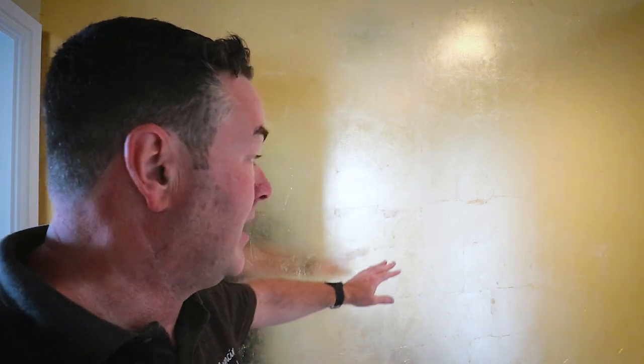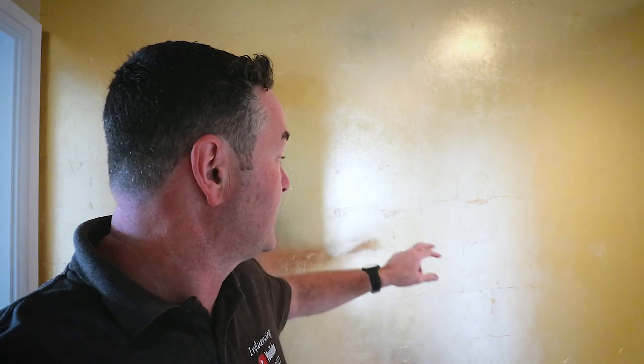I'm just going to go over that skirting top edge again with a bit of that purple tape, mainly because I'm going to go with the varnish now. I'm going to brush it to start with, just so I know that I've got it all on, and it pushes down the actual gold leaf. If anything's loose, it shouldn't be, because I've brushed it down. But that's what I'm going to do, and then I'll show you what it's like when it's finished. Now I'm going for a gloss varnish, because I still want to keep that gloss gold shiny effect. Now I'll let that dry for 24 hours before I put any more coats on, but I have still got other trades to come in and finish off in here.